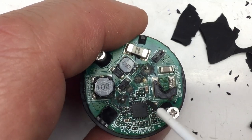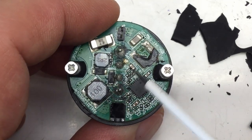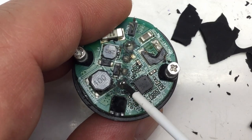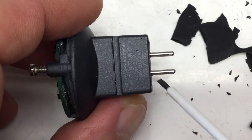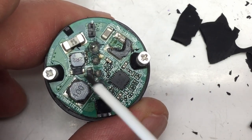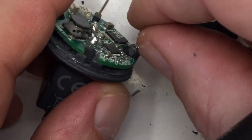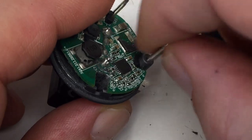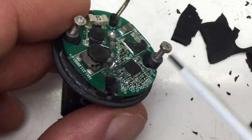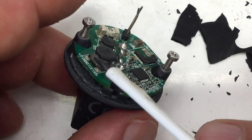And we have a real microcontroller here — lots of pins. And did I mention it's double-sided? And obviously it's going further down, because we have here four solder bumps but we only have at the back two connectors. I still don't see four diodes which could form a bridge rectifier — I mean here are two big-ass diodes but not four. And did I mention these are real screws that go into real threads — no self-tapping crap. I mean, for something that you put together exactly once and then when it's broken it goes to the landfill, this is such an overkill. It's unbelievable.